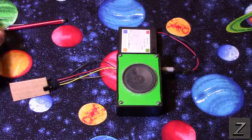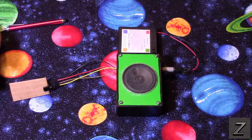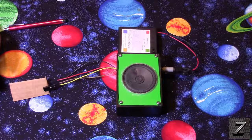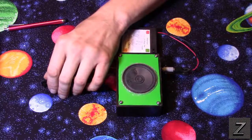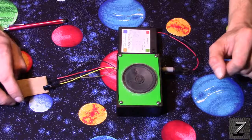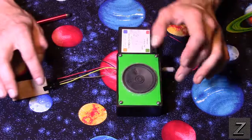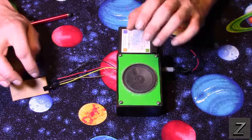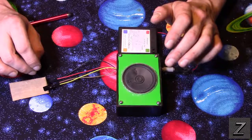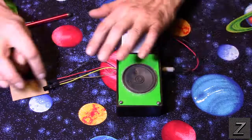This is just a basic little alarm for if you're at home and you want to know — maybe you want to put it on a closet door or refrigerator — so you know if your little kid opens it when they're not supposed to be in there. For a burglar alarm, if you had it on your door it would let you know when it was open, and if you put a louder alarm on there it would probably wake you up. You can also run the sensor further from the control box using telephone or ethernet cable, which is extremely cheap and works perfectly, so you don't have to have the alarm box right next to the sensor.